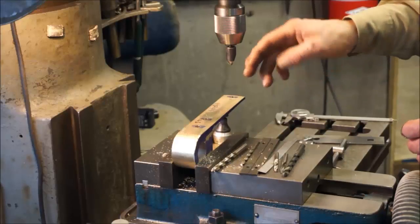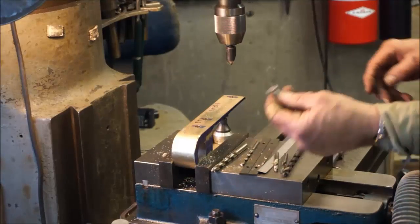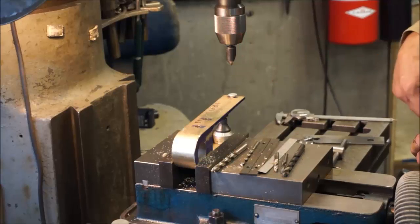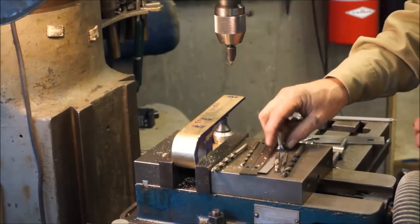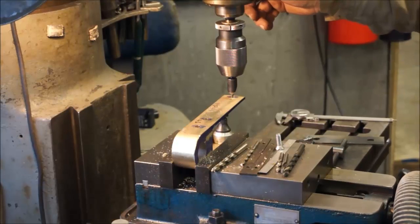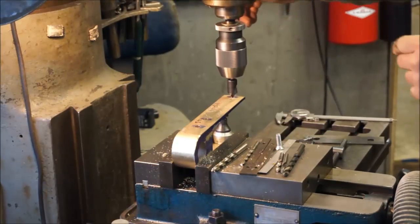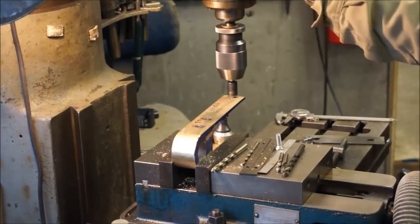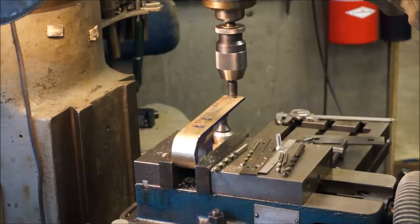The last thing we do before we pull our drill chuck out is going to go ahead and put the countersink in here for our screws that they want to go through here. Now I'm going to go ahead and spot this down a little at a time, and I'm going to lock this in also. I don't want this to grab.